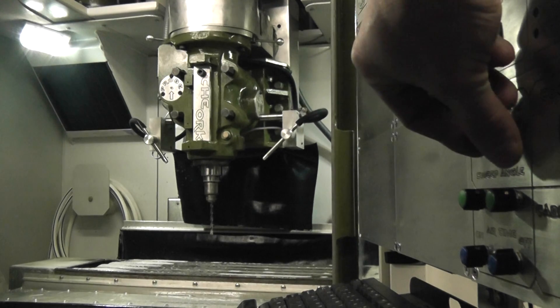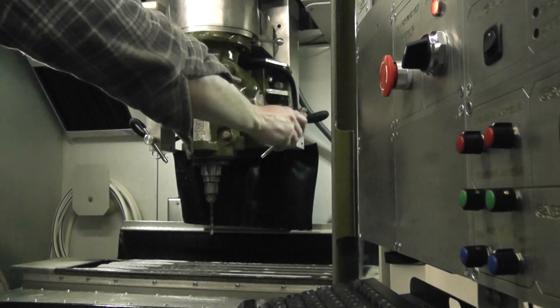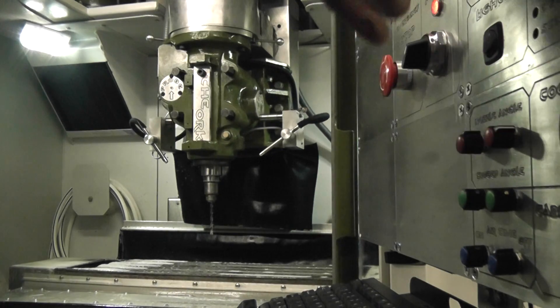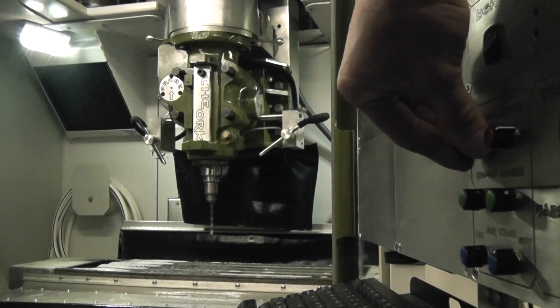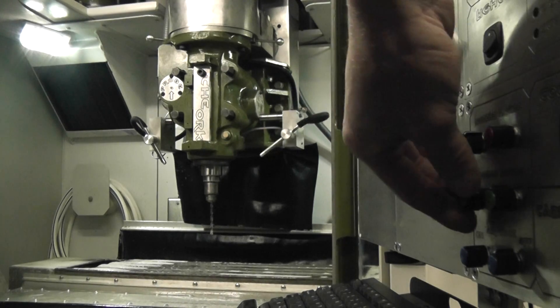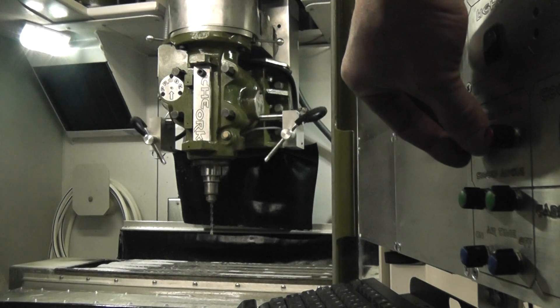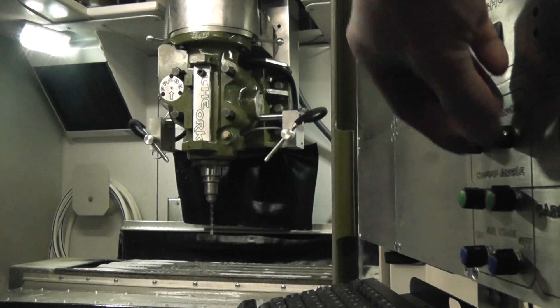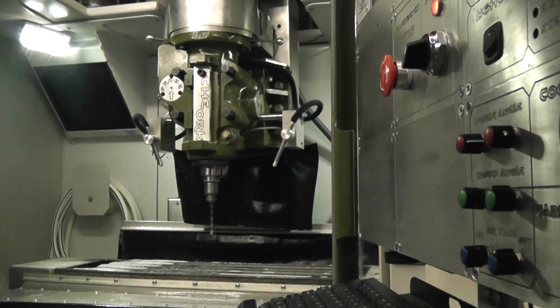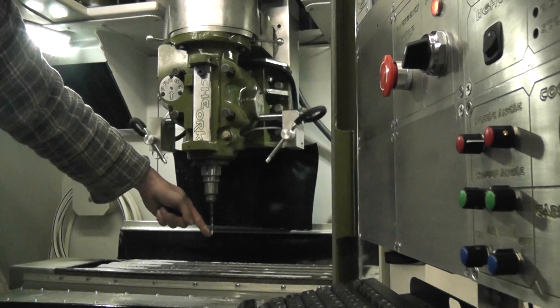The knobs turn the same direction. The sweep knob controls the sweep angle — I basically have it set up to about 60 degrees. So even though the sweep angle is at the maximum of 60 degrees and the angle of the nozzle is also 60 degrees, the sweep always starts at the bottom of the tool and works its way up.